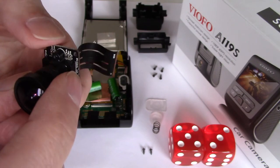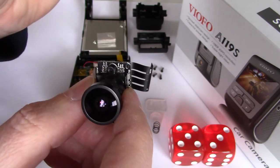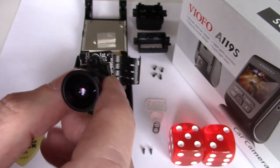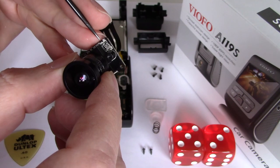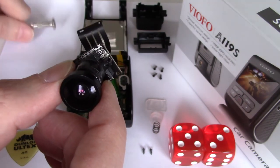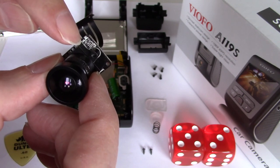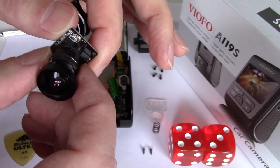This is the alignment we're trying to achieve. On the left side, there is a larger capacitor right against where the housing is — you don't want to shift it so much that you bump that, or you'll break it off the circuit board. On the opposite side, where we are moving, there are five tiny surface-mounted capacitors and the housing will actually hit them. We don't want to go quite that far, because this is a metal base and those are metal contacts with no insulation between them other than the black paint, which is not a great insulator.